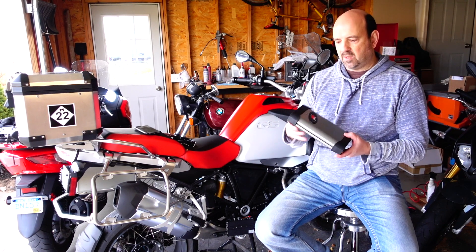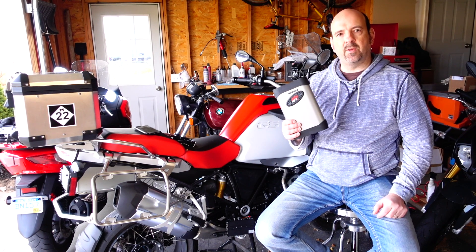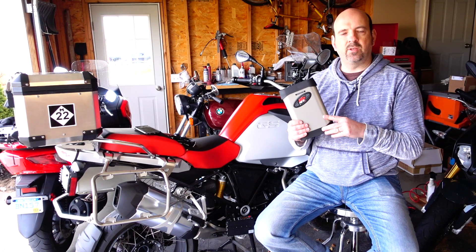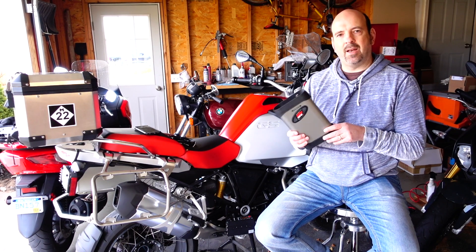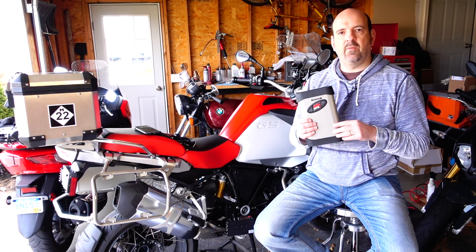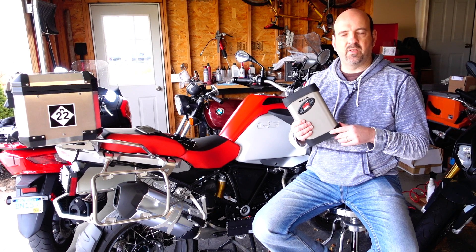So I've decided to borrow one of these devices. This is the Observer 1000 — a 16-channel portable DAQ/analyzer. What I'm going to do is connect two accelerometers, one to each end of the handlebars: one on the right side and one on the left side.